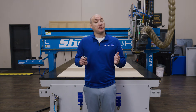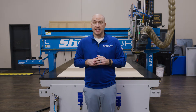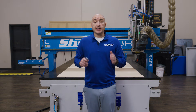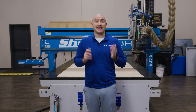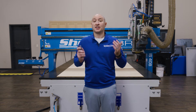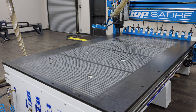This is common with MDF doors but can be done with any tool that requires higher accuracy. This helps reduce ridges and visible tooling marks. It's very important to take a few minutes to dial in your tool heights — it's ultimately going to save you from added sanding and rework later, especially on something flat and visible like this door panel project. Now that we've set up our tooling, let's chat about the vacuum system.